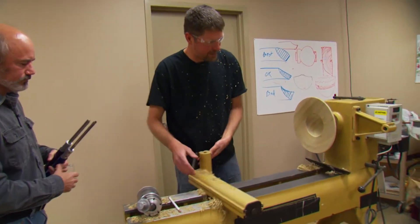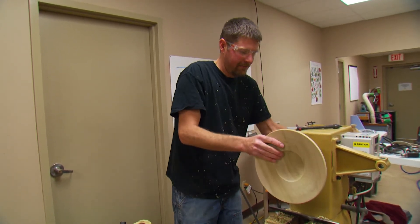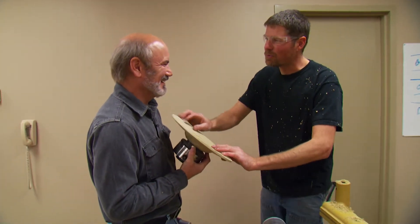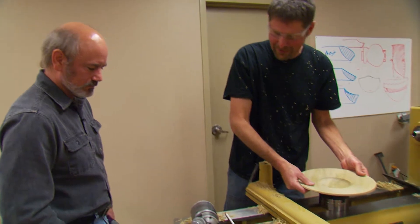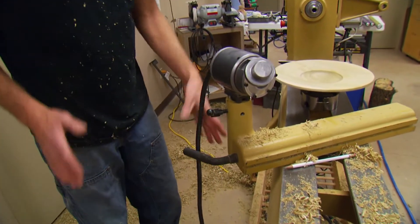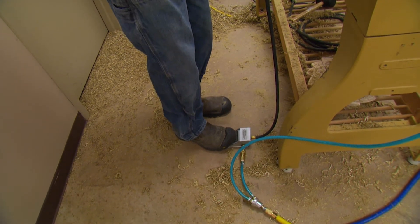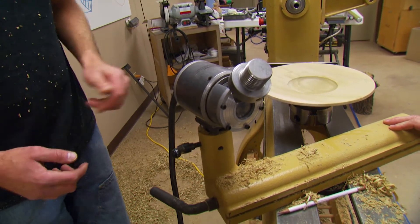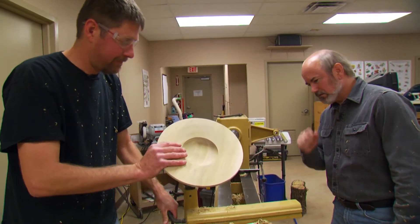How do you go about doing your carving? I use a lot of pneumatic tools, but first we need to figure out how to hold the piece. I've designed a pneumatic carving stand that fits right in the banjo of my lathe. I hit the foot switch, it releases the air and allows me to move an axis — basically a ball joint — giving me access to the whole piece while I'm carving. Let up the foot switch and it locks in. It has the same thread pattern as my lathe and chuck.